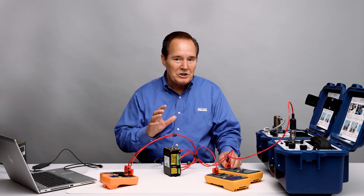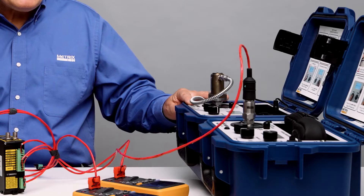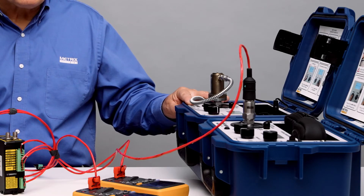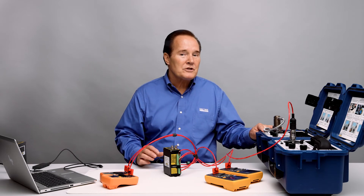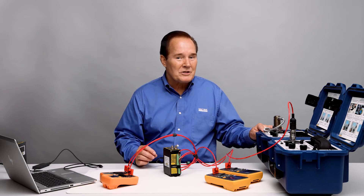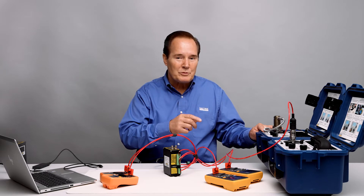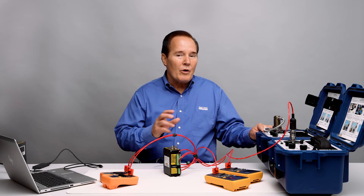What's unique about this demonstration is that the SV6300 is a piezoelectric device with an integrator built in, whereas in channel two we have a moving coil device to give us our velocity. This is our 5485C high temperature velocity sensor. It gives an output of 200 millivolts per inch per second, which is different from channel one. Channel one was 100 millivolts per inch per second; this is 200 millivolts per inch per second, and it's a moving coil type.